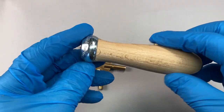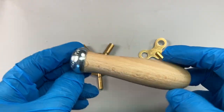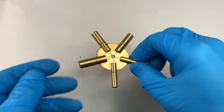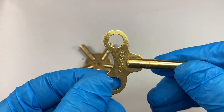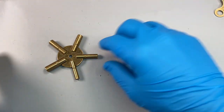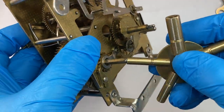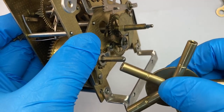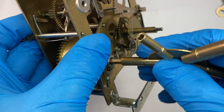In this video I show you how to make the tool out of a dowel — or in this case a file handle — and a star key or clock winding key. The star key makes a really great donor for the beginnings of a letdown set. You normally get these keys in pairs: one has odd and one has even sized holes, and you can see this one has five different sized winding squares in one.